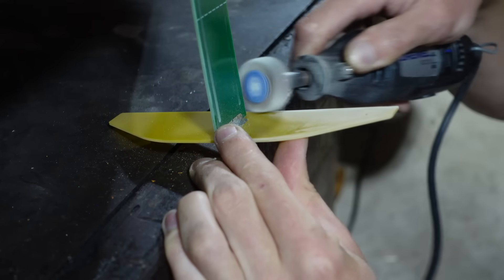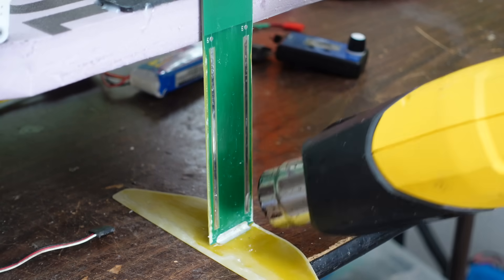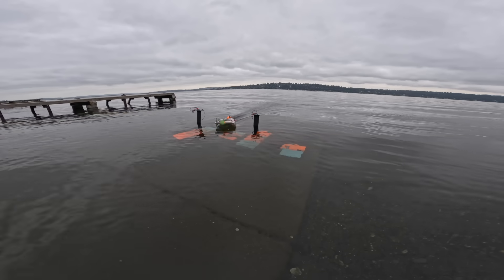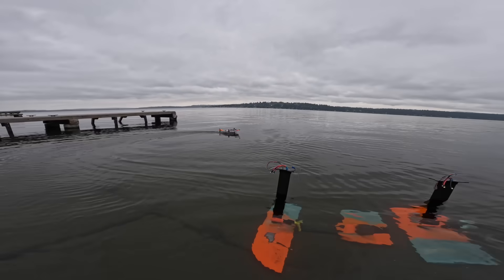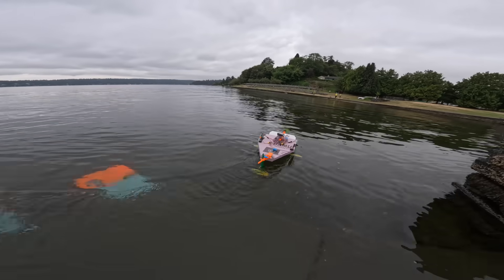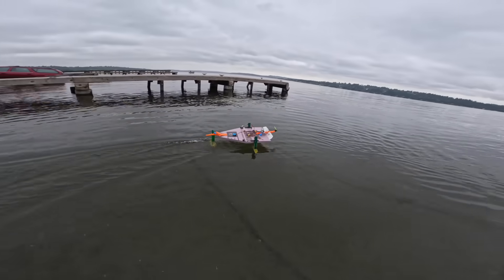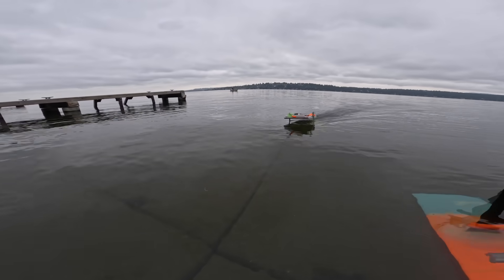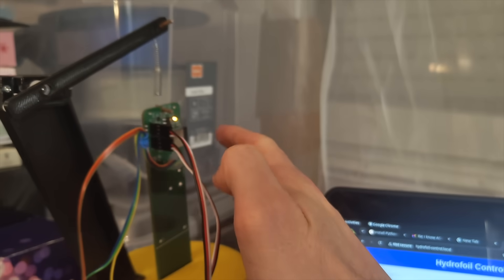It was finally time to try sharpening the hydrofoil edges so that they're not just a bunch of 90-degree corners. I sharpened the mast edges too, and also waxed the solder mask to hopefully get water to fall off more quickly. The sharpened masts and wax did seem to help quite a bit, though I did not sharpen the rear foil — probably should have in hindsight. The boat was really easy to drive — easy enough that I could hold the RC controller and steer with one hand and hold the camera with the other. You don't need to do any manual attitude control; the PCB hydrofoils take care of all that for you. With too much throttle it would start to hydroplane rather than hydrofoil, suggesting I need to do some PID tuning.